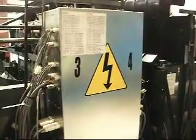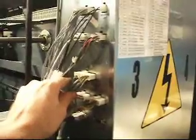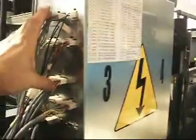So now we're on the front of the same pin setter by the Nexgen box. Since I am working on just an odd lane right now, you want to check all your connections here, especially P5 on an odd lane. They have to specifically look in the book. So a P1 or a P5 on an odd lane, and a P19 and a P23 on an even lane.